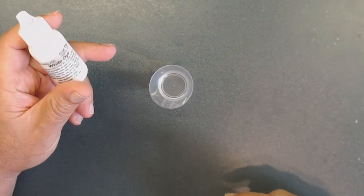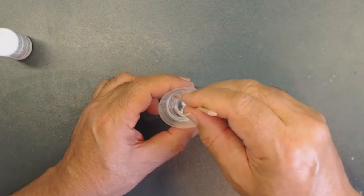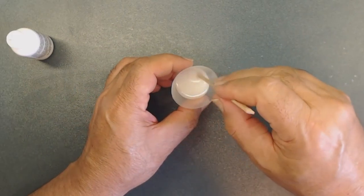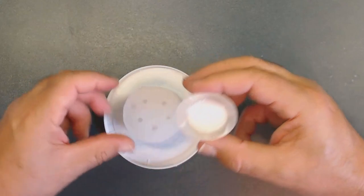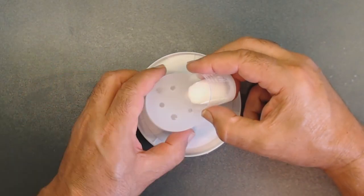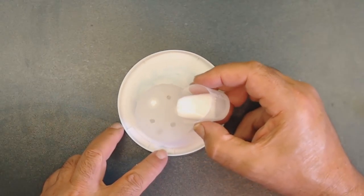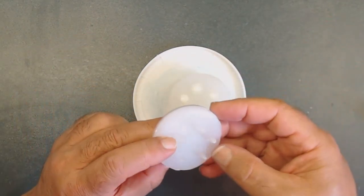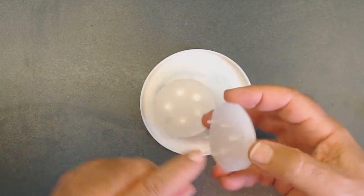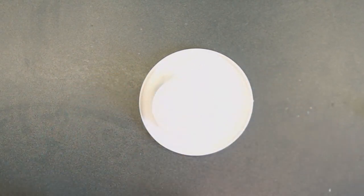For this batch we're going to use white dye — I think one drop is fine. Add it in and mix them really well, being gentle so it doesn't create bubbles. After mixing well, fill all the cavities in the mold. I made a little extra so I wouldn't end up short. Then get the top half of the mold, line up the registration mark, and close it gently. Now let it sit until totally dry — it might take a few hours.